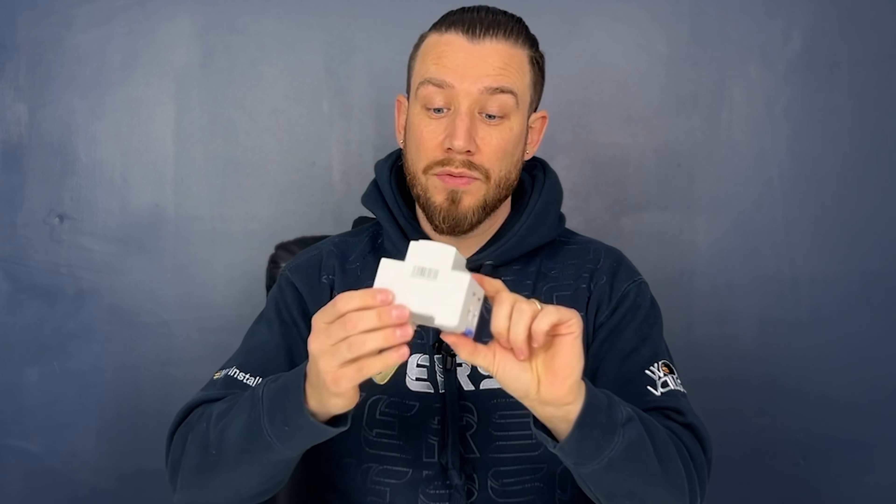So I'm going to start by talking you through what is a Type B RCD. Well, this right here is a Type B RCD. It looks very similar to a Type A — one thing you'll notice though is it's an extra module wide, so it takes up three spaces on your DIN rail. It does fit on a standard DIN rail just like any other RCD. Apart from that it operates exactly the same as any Type A that you're already currently using.